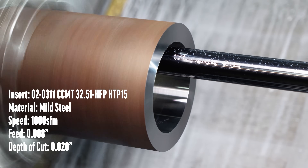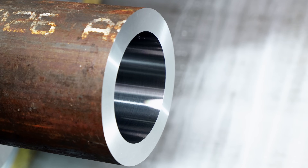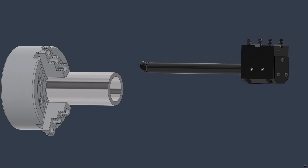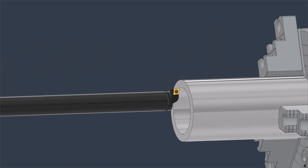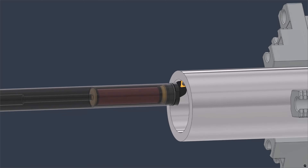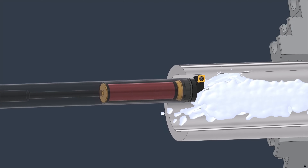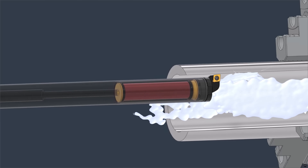The difference in vibrational response is evident. The Haas anti-vibration damped boring bar is engineered with a pre-tuned internal damping system. It absorbs and dissipates vibrational energy within the tool body, even at this extreme overhang. This enhanced dynamic rigidity reduces chatter, leading to a consistently smoother surface finish, tighter dimensional tolerances and prolonged tool life.